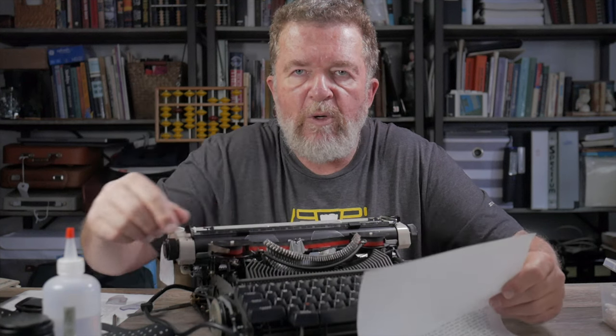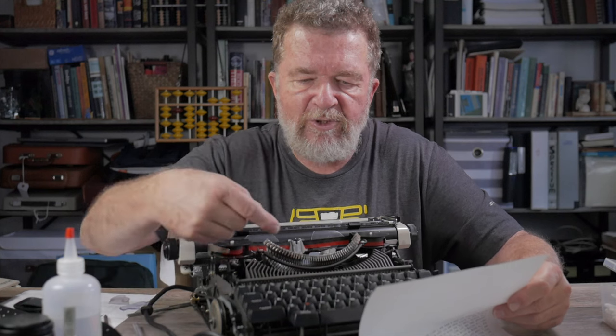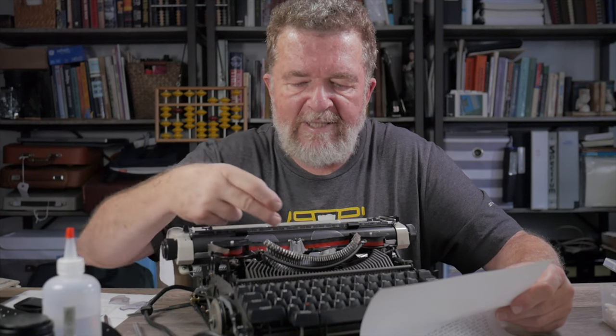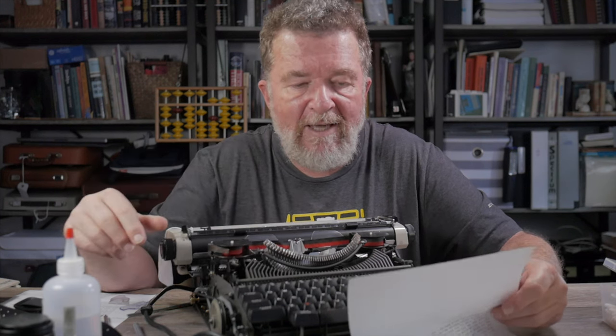As I was troubleshooting the piling-on-letters problem, I came up with five or six different theories. First: hard platen causing type bars to bounce off faster — I tested with really thin paper and then with 30-pound paper, essentially like a backing sheet, and didn't really notice any difference. So I don't think that's a major factor. On the half-space escapement, the second trip point: it turns out you can't really adjust the timing of the second trip, only the timing when it first trips.